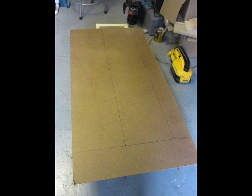Regarding the masonite, masonite's a brand name for tempered hardboard, and most stores are going to carry a generic flavor of this instead of the actual branded masonite, but what you're looking for is tempered hardboard, and I recommend a thickness of 1/8 of an inch. It's more common, and it's also going to be a lot lighter in the total case fabrication. There's no need to go to 1/4 inch except on maybe the very largest cases. Most cases of this type that I build don't end up being more than maybe 1.5 feet on the short dimensions, and maybe 4 feet or so on the long dimension. And between the masonite at a 1/8 thickness and the stringers, that's plenty of rigidity.